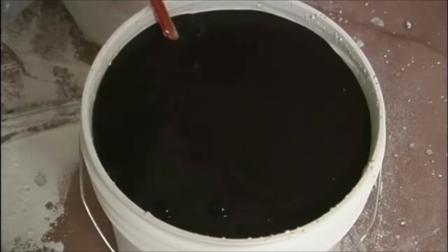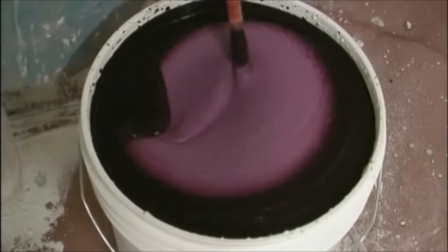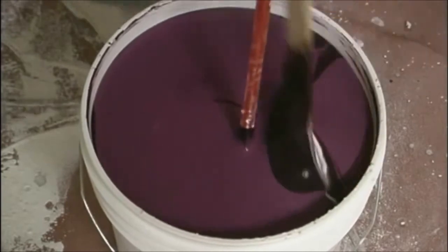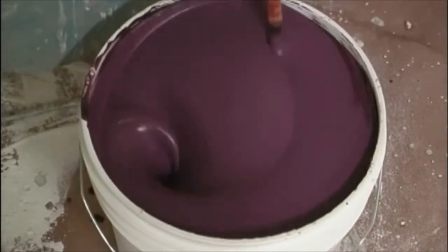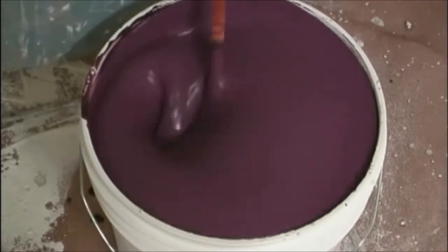You can easily tint our plasters or lime wash with universal tints, as used for coloring paints. Most universal tints are made from natural pigment powders and will not fade in color. Beware of raw powdered pigments, as they have their own unpredictable chemistry and are sometimes too coarse to be used in finer applications.